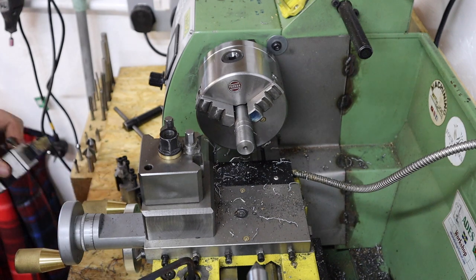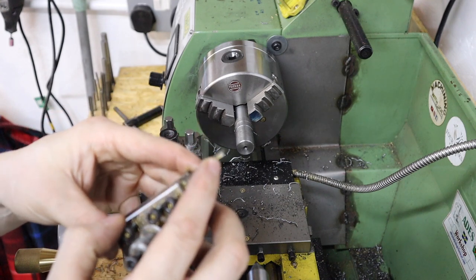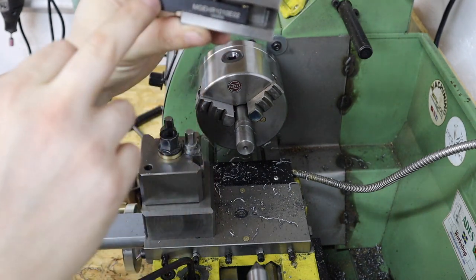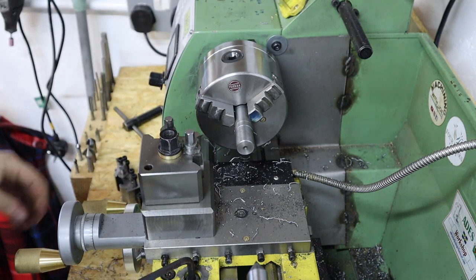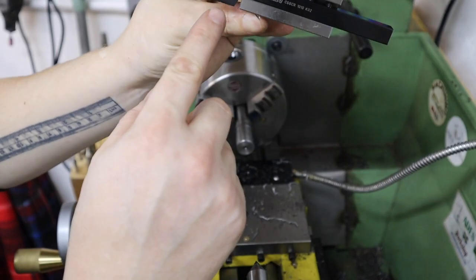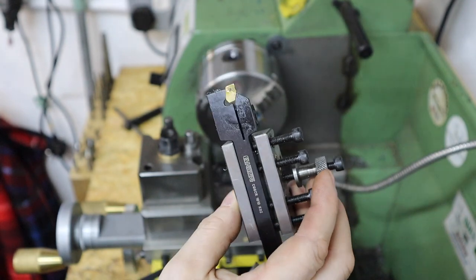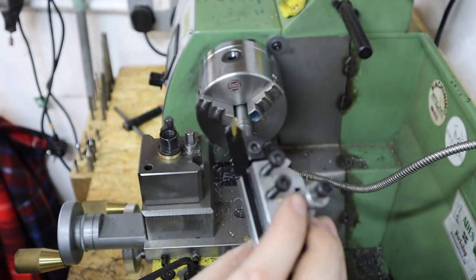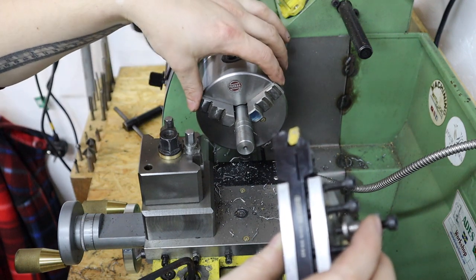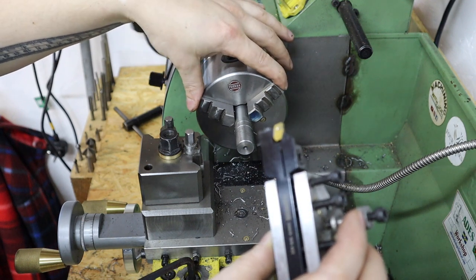I think I've found the issue. The normal parting tool I use on the lathe has a 2mm parting blade with a neutral rake profile. The parting tool in this kit is a 2.5mm parting tool with a bit of positive rake, so I think this parting tool is a little bit too aggressive for the mini lathe. It might be perfectly fine in brass and aluminium, but for this mild steel EN3 bar it's getting a bit dicey, so I'm going to leave that test there.